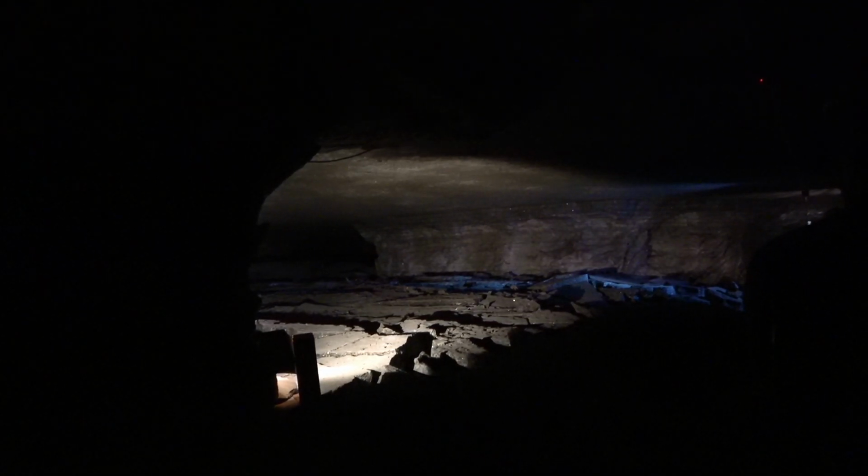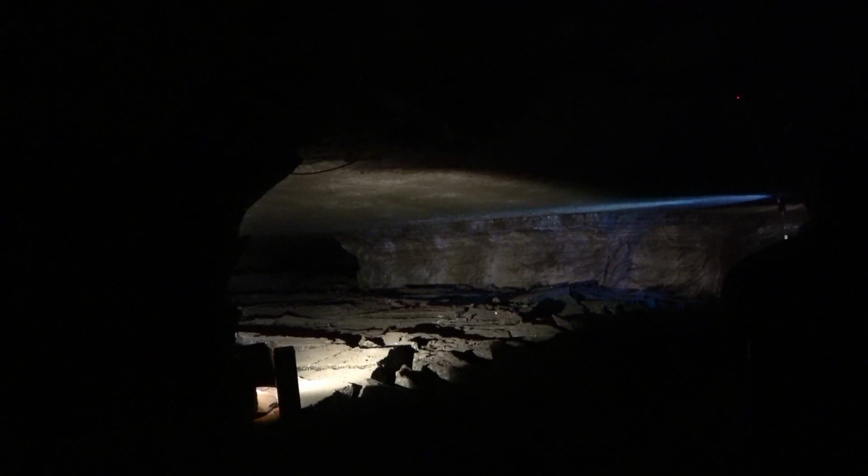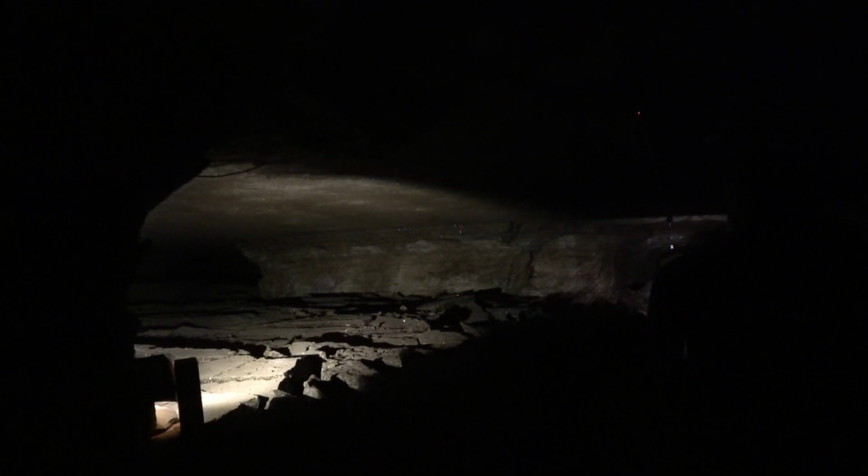As you look to your left, you'll see a rare sight, what the miners call a roof fall. The pieces on the floor used to be the roof, but over a number of years, the salt started sagging away from the compacted mud layer above it and eventually fell. Now, even though only a few rooms ever develop a roof sag, everywhere in the mine that people will walk, drive, or ride, we monitor the roof, and sags are removed when necessary. Can you imagine how it must have sounded when this roof fell?